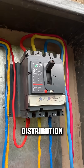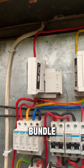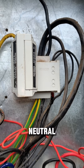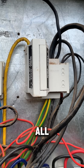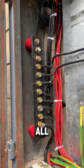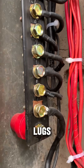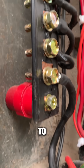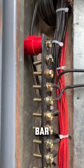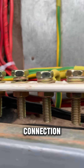If we are wiring a three-phase distribution board, we must ensure that we don't bundle up the wiring for the earth connection as well as the neutral. Ensure that all the cables that are neutral are all connected individually using cable lugs, tightly connected to what we refer to as a neutral bus bar, so that this connection is very, very tight.